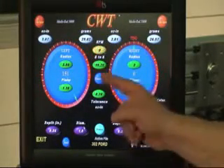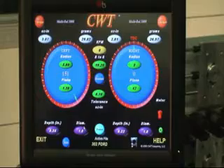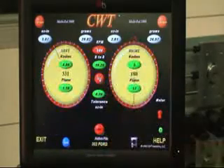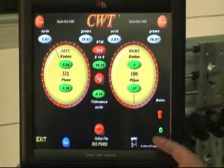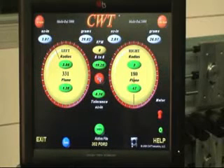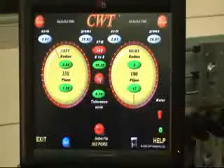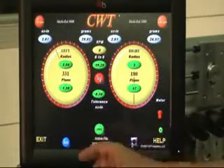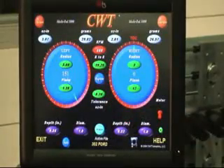Next, you see a remove button — right now they're blue, which stands for removal, and you'll see the drills are in place. As soon as I touch add, it goes yellow, and we're giving you a caution saying you're not going to remove weight, you're going to add weight. I've dropped out any drilling to give you an additional cue so you don't continue drilling when in add mode — that's a frustrating mistake. Yellow means add weight. Blue means remove weight.